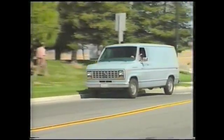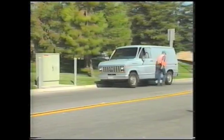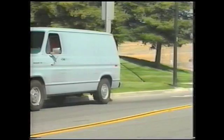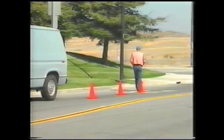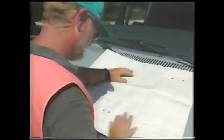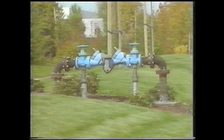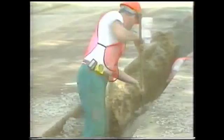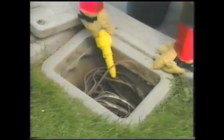Before leaving for the job site, check the transmitter, receiver, and A-frame batteries. Replace or recharge them if necessary. When you first arrive at the job site, there are several things you should do before you begin to locate. If you are working in or near a street, always wear your orange reflectorized vest and use cones, red flags, or whatever safety precautions your company requires. Consult the blueprints or as-builts if available to determine the general location of the cables in the area. Use transformers, meters, or other visual reference points to help orient yourself. Also look for obvious causes of cable damage, such as new construction or excavation. Because pipes and cables may carry live current, use a voltmeter before attaching the transmitter to any conductor.